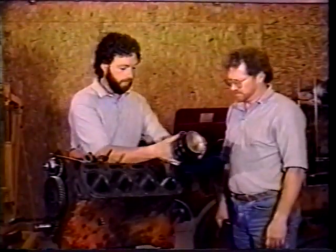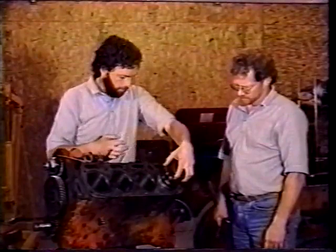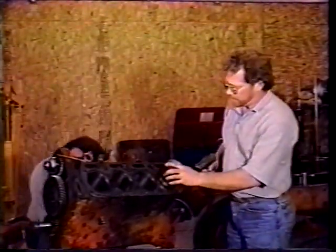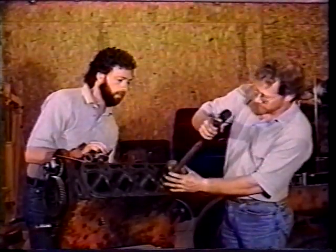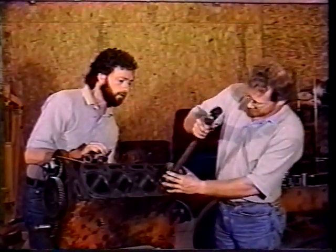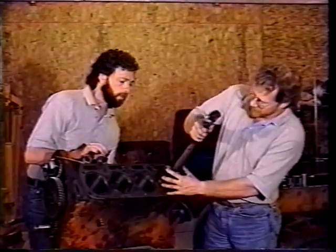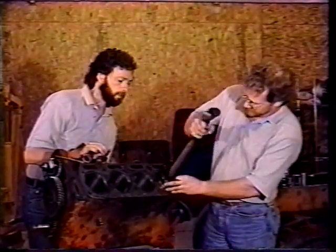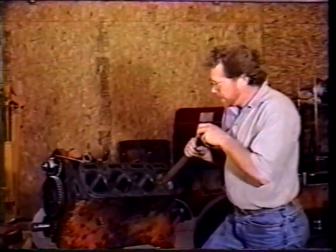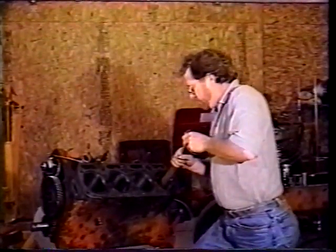So now we're ready to put this rod back in the engine. Okay, I'm looking at the numbers on the cap. And also, when you're doing this, make sure that your crank throws are all the way back, so it's the farthest out of the way. You just lightly tap down on it, holding the ring compressor tight against the top of the engine. And it'll slide right in there. And now we'll just push it down until it butts up against the crank. Hold on. A little more.